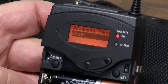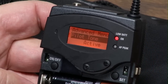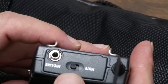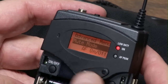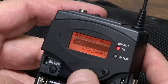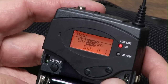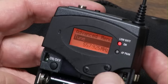You can adjust the contrast. Pilot tone — we talked about pilot tone on the receiver. Cable emulation — I leave it at factory defaults minimum. Mute mode — I always disable the mute mode. Here's the mute button: you're going to have a speaker, they take a five-minute break, they reach down and hit mute, and then you have no audio — it's ruined my day more times than I can count. So I disable that button. You can tune this by simply going in and picking the left half of the frequency and then the right half, but I have never used this. I always let the receiver select an open frequency and then do the sync, so I find no need to tune it manually.